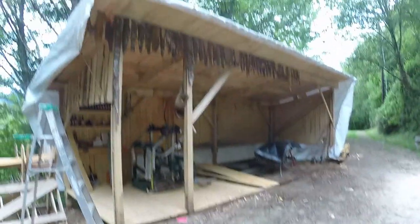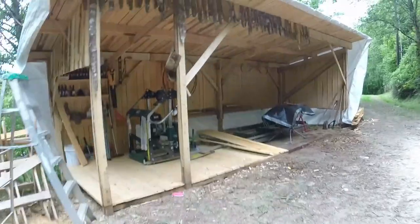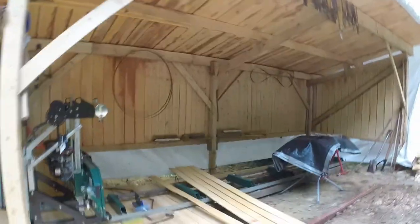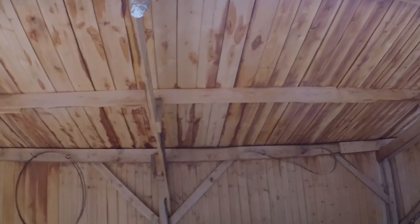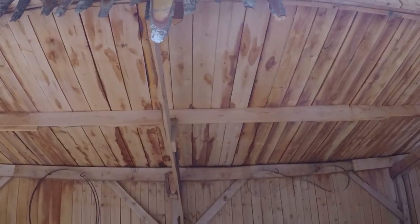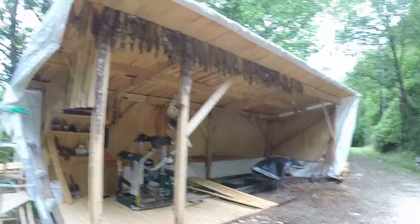My roof is not 100% waterproof. Most of the small leaks that developed are where knots that I thought were tight are not. But we're also getting some water under the battens and between the roof boards that is not being captured by the routed grooves in the roof boards. We have rain forecast, so I remembered this huge old tarp. It's now my new roof.